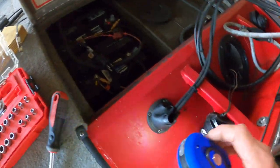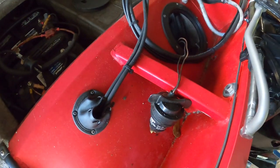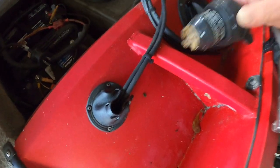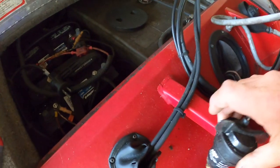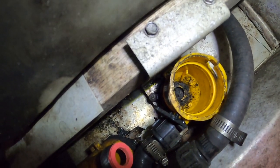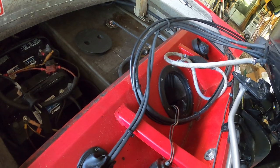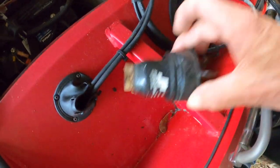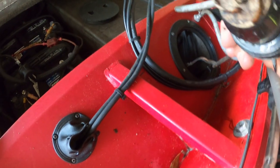After a few hours of rest — this is Sunday, my day off — I've replaced the switch on the bilge pump, but that didn't fix it. We have a clogged pump. I'll try to get the camera down to show you inside the housing. It's just gunked up something rough, so the first thing I'm going to try is to clean it and test it again to see if it'll run.